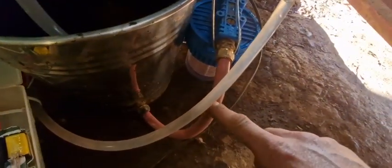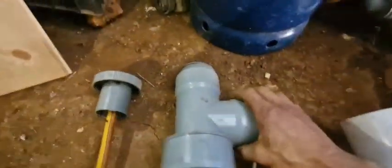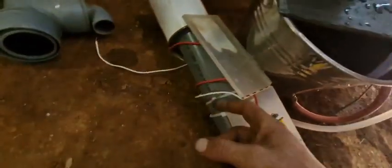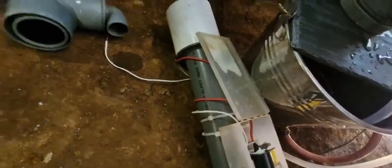Then the pump is pulling it through a filter, so the particulates get out, and there's a one-way valve, so there's no back drainage, so easy startup, and then it's getting pumped into the upper chamber where the laminar flow starts. For the upper part, we have about the same construction as the down part. This will fit inside here, with the gas outlet here. As for the gas inlet here, the gas travels upward, and the particulates will be thrown to the side by the electrostatic field and be washed away by the water.